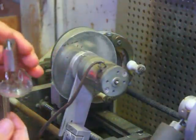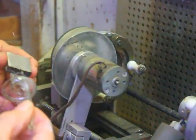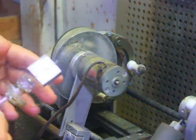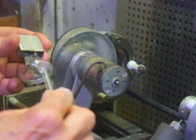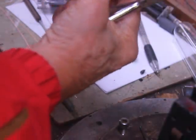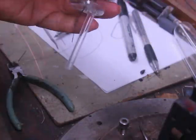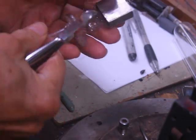Here is the guts. The filament is completely destroyed — it's no good because it's been exposed to air. And that pinch is no good. So the only thing we can do is save the grid and save the plate, but all the rest of it is junk. We need a new flare to go in the bottom, a new pinch, and a new filament. First thing we're going to do is remove the plate. These getters are no good. We'll cut the plate off of there.